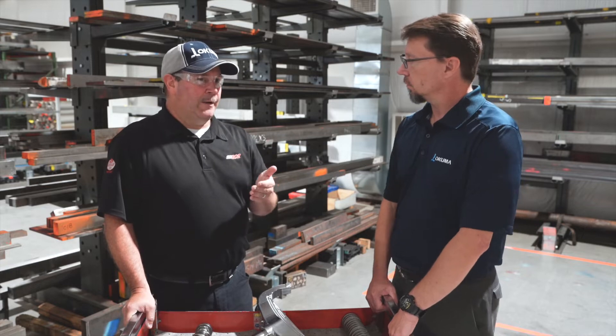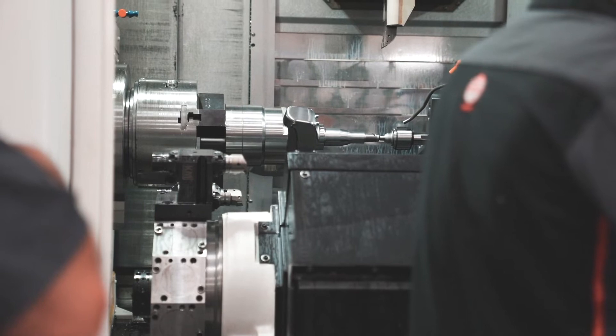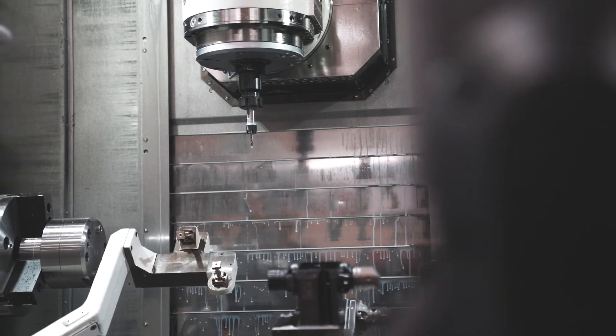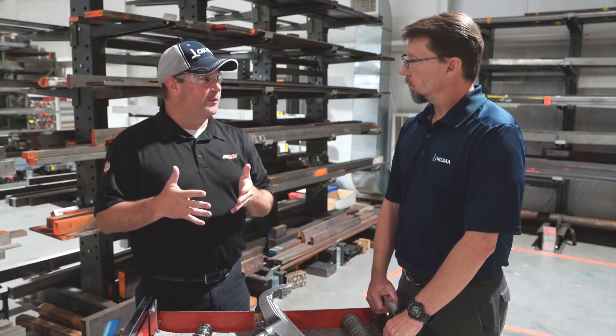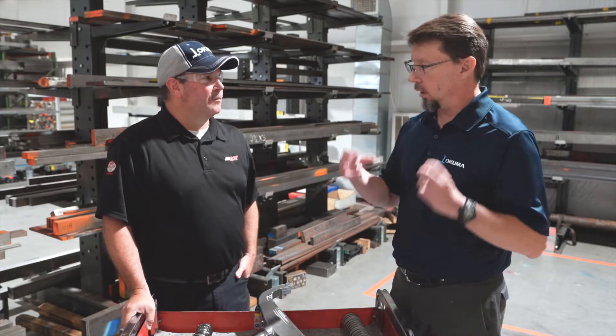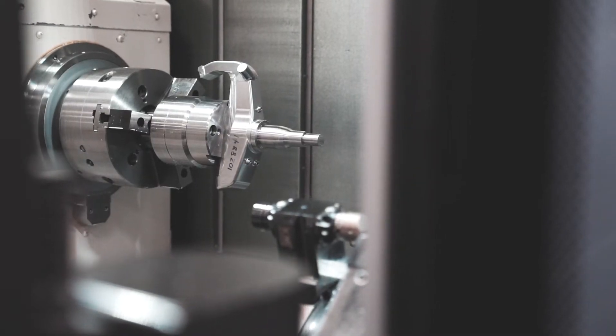How long have you had that machine? We've had that machine for about four years. We kind of brought that machine in — it was the very first Mill-Turn type machine that we had — and we wanted to bring more complex parts and be able to do them in one operation. So with the milling and turning integrated together, the U4000 has the lower turret. You also have the option of working on the main spindle and the sub spindle simultaneously. We have the full five-axis capabilities, so we can also do intake manifold and cylinder head manufacturing on that machine. The more work you can do in one operation without interjecting operator intervention, the tighter tolerances you can hold and the better your quality can be.